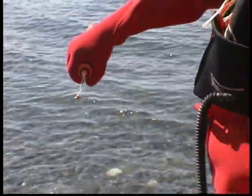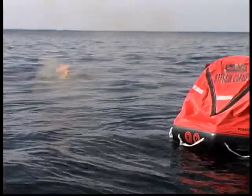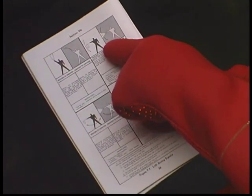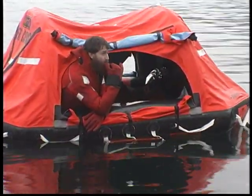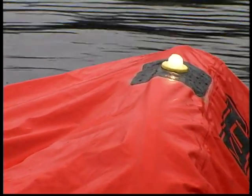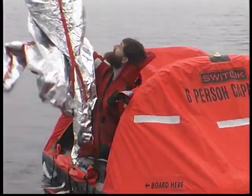Different handheld flares have different firing mechanisms. Smoke is especially useful on calm days — helicopter rescue pilots also find smoke useful to judge wind direction. The cans of smoke float, and due to the heat they produce, should be tossed into the water well away from the raft. A copy of life-saving signals is included in SOLAS A and B packs. The whistle is three to five times louder than the human voice. The flashlight has an extra bulb and batteries. The life raft also has an external dome light that can be disconnected when not needed during the day. The canopy has light-reflecting tape. Other items may be used as signaling devices — use your imagination.